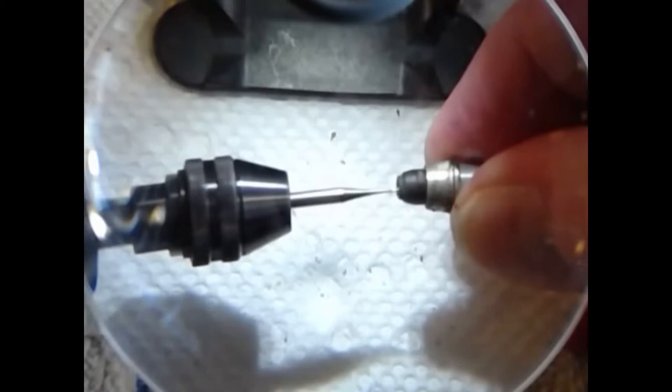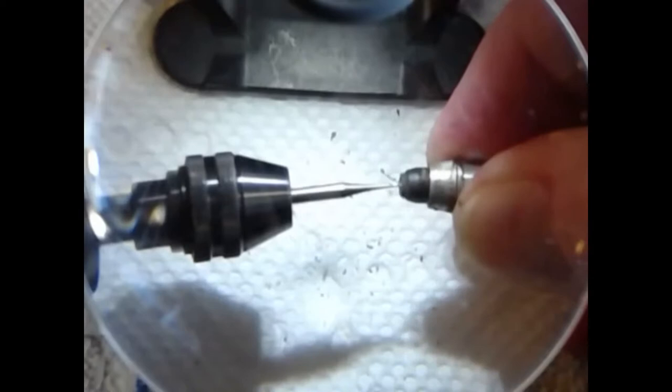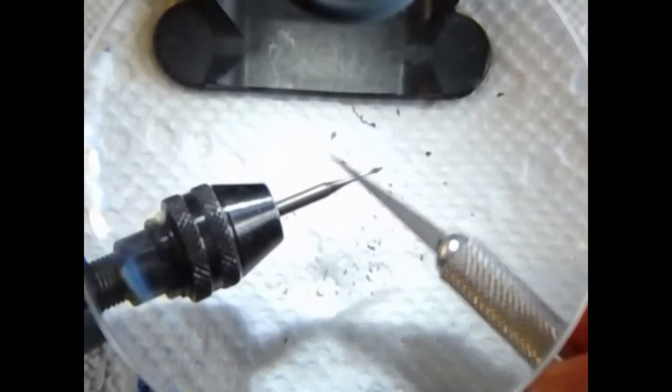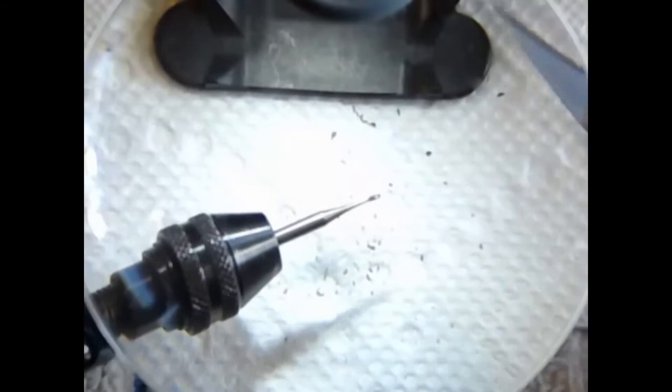What you're going to want to do then is come back to your Dremel and again try to hold the tool steady and move the work piece — in this case the filler mechanism — toward the Dremel. I can't emphasize enough how key that is to have success in doing this without damaging the pellet cup. Again we're going to use the number eleven exacto knife to clean off the bits of the pellet that are stuck to the end of the burr so that we've got a clean tool to work with.